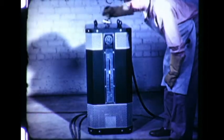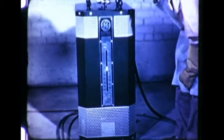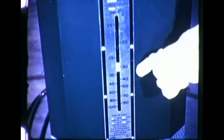Atomic hydrogen welding is best accomplished in the flat position. The current setting is made to establish a speed of welding which the operator can maintain easily and uniformly. About 30 amperes will provide average welding speed on 3/32nds inch material.